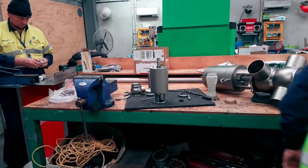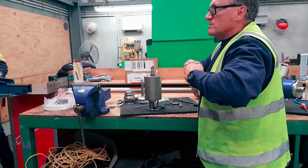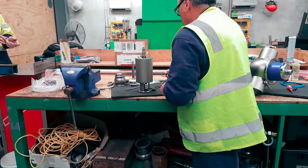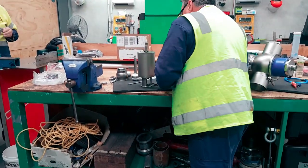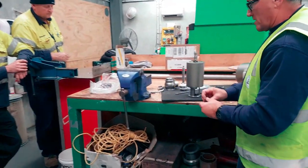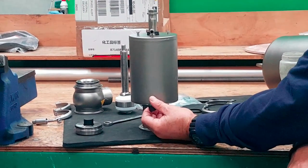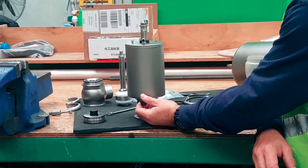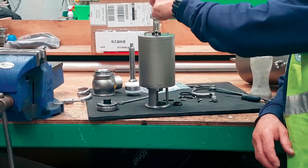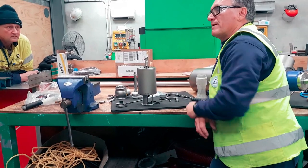Okay, I want to show you the water ejector. Just on there. Right, when you put a new one in, just give it a little bit of a stretch, so it's got a bit of tolerance in there and stays in. If you soften that up, it'll last for a long time. Always carry something spare when you're servicing. That's the water ejector. This little pipe sits on the side of the actuator, pointed in the direction where it's going to get the least amount of water, where they can spray chemicals or hoses or whatever. Better still, if you're in that situation, start looking at other options in your control head and piping off, so you only get instrument air coming in and out of there, and it can be done.